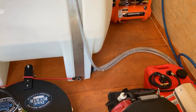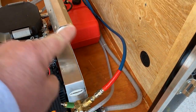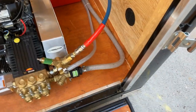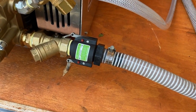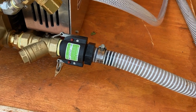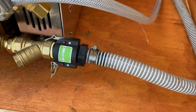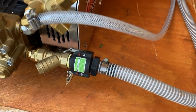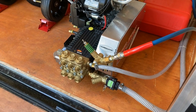We've got the 225-gallon water tank plumbed over to the pressure washer, the small hoses, and the bypass hose that goes back to the tank. At the bottom we use a banjo for the water inlet so it can be disconnected — water can be drained out, wash your hands with it, emergency eye station if you need to flush your eyes, but mainly so you can drain your tank easily before you leave the job site.